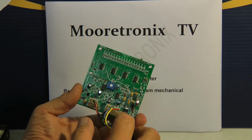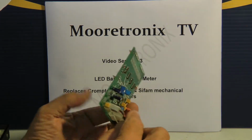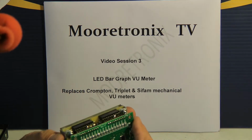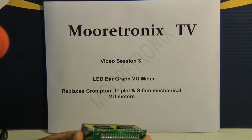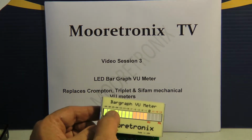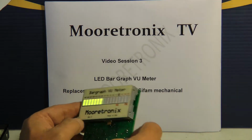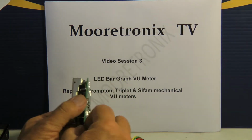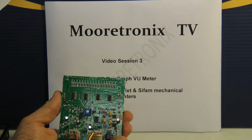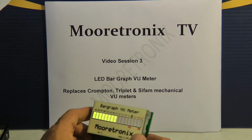This meter also has one additional feature, a threshold output. It's opto-isolated open collector, and it is user programmable. Let me reattach our display again to the meter. So you could select any one of these LED positions and use that as a threshold for an output on the back. There's a small 2-pin connector to take that open collector signal, which could be used for alarms.